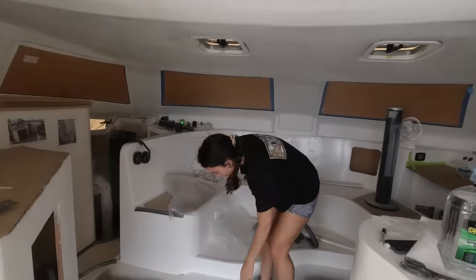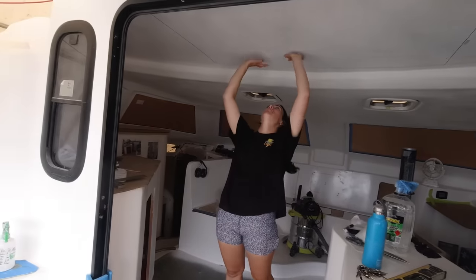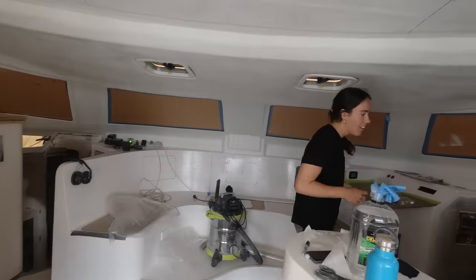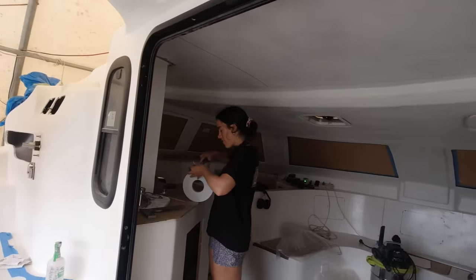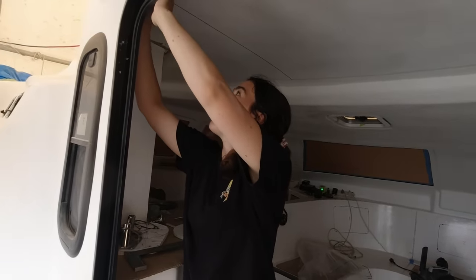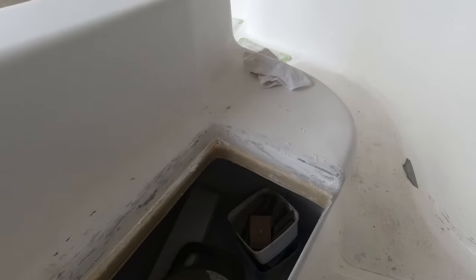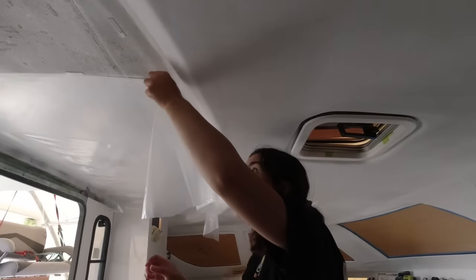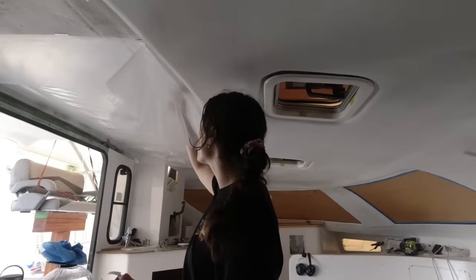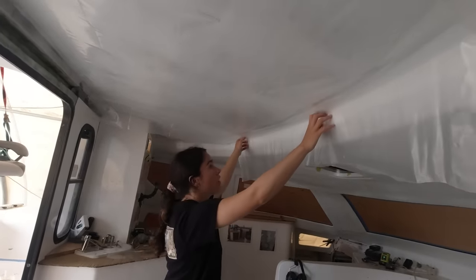The templating's going well — second of three done. It's not easy; the head height is very low in our boat. The trade-off of having a low windage profile is low head height and a high bridge deck — so we get a combination of less slapping in the hull but lower headroom. There's fairing compound on here that's going to take a bit of cleaning up — that'll be a good sanding job. The double-sided tape is working a treat today, so much better than the old stuff — that single center panel is actually good because it's not going to be too heavy.